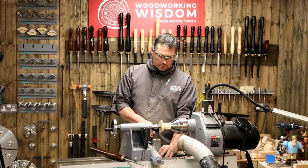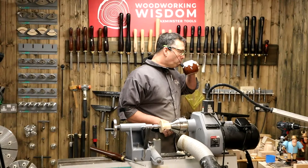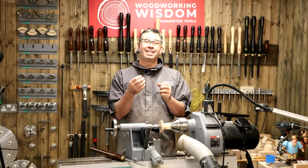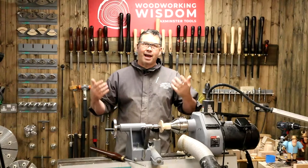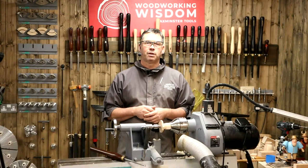And Nigel would like to know, he's made a couple of smokers, and although they smoke okay, they don't smoke for long. Is the quality of the incense cone important? It is, but what I found is you've got to get them really hot, because I've had the same issue. You've got to get them really hot before they stay burning. So what I like to do is light the incense cone and just leave it with the top off for about a minute and a half before putting it on. The vent holes, I've increased the size of those as well to 8 mil. So 2 8 mil holes to get that airflow, and a 7 mil hole for the mouth. That's really important. So you're getting lots of airflow, and that should keep the thing alight and keep a nice amount of airflow going.